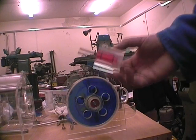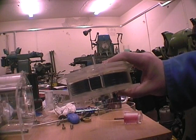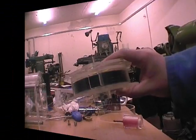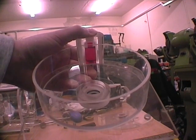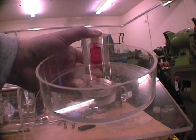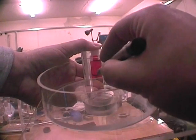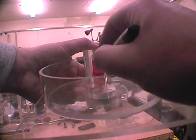Once you've made the air injector assembly, you'll still need a hole in the top of the turbine housing to let the air into the discs. Place the turbine housing on one of the end plates, fit the air injector assembly, and then draw around the area that requires to be cut out. Use the lines that you previously marked on the air injector as a guide.